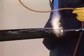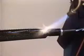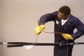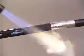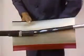Ignite the torch and preheat the rail and channel area until shrinking begins. Then move to one end of the sleeve and start to fully recover the sleeve, working around the entire circumference. Work gradually toward the opposite end of the sleeve. Be sure to convert all the green heat sensitive paint. Continue the long length repair by applying a second WRSS sleeve over the remaining cable opening. The second sleeve must overlap the first sleeve by three inches.